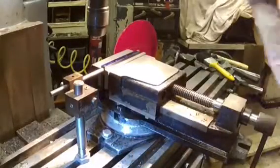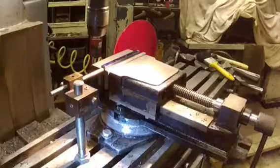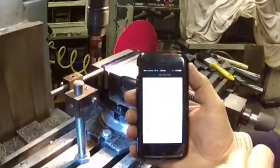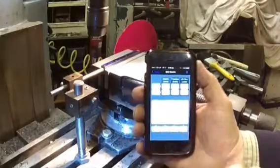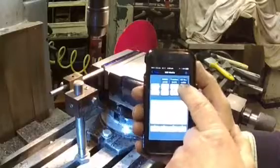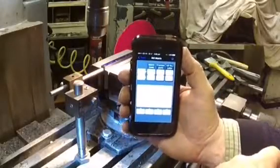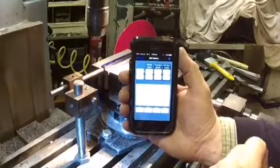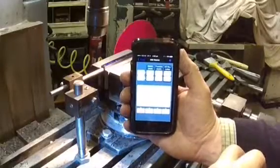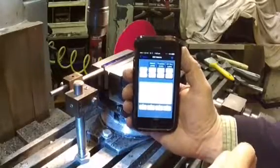This is more fun, right. We've got that now, we've just got to line up and find a drill bit. Using the drill bits tapping tool app on my phone — it's metric and we put the size in, which was M4, and now that gives me the correct drill for the job, which is 3.3mm or 1/8, or US number 30, and that's M4 at 77.6%. So I'll go and route around to see if I can find a 3.3.